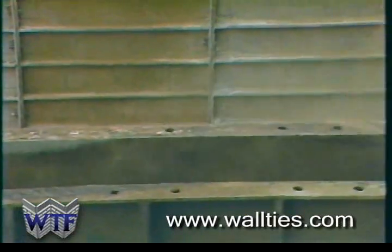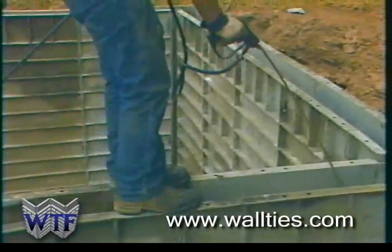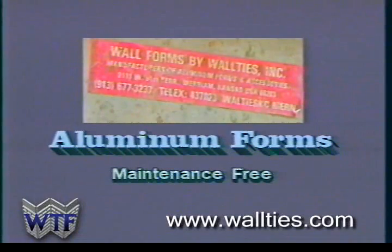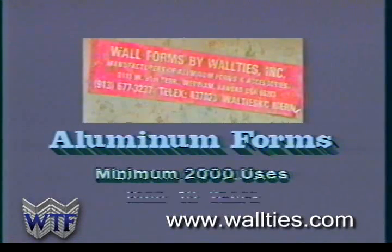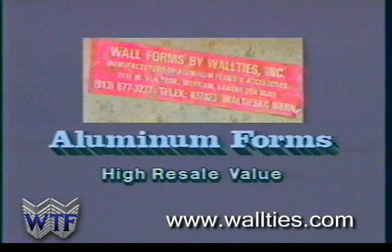In preparation for pouring of the concrete, the forms are then sprayed with a form release agent. Aluminum forms are essentially maintenance-free, and with reasonable care can be used a minimum of 2,000 times. It is not uncommon for wall ties forms to be used for 10 years or more. However, when the forms do wear out, the inherent value of the material allows them to be resold, oftentimes for more than the initial cost.